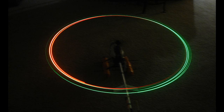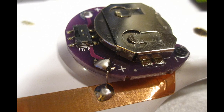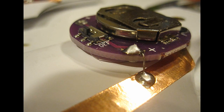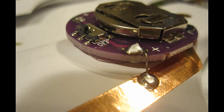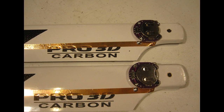So here I'm going to show you how I did it and the drawbacks. First of all, the Lilypad coin battery holders with the switch is one of the best and most compact ways of providing power to the LEDs that I've found, and it makes a nice clean installation on the blades. They only cost $6.95 each and can power several LEDs on one 3-volt battery when wired in parallel.